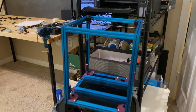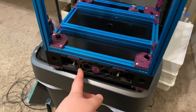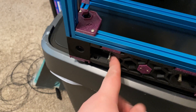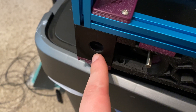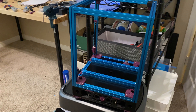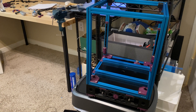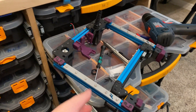Let's take a look at the progress since the last episode. I've mounted the skirts and also the Z drives — this is just a test fit to see how everything goes. The decorative piece isn't mounted on the front and rear skirts; I'm still printing those. More importantly, you'll notice the Z drives are empty, which is one of the delays for this project. I ordered the 64-tooth pulleys but I'm still waiting for delivery.